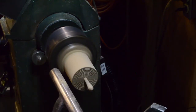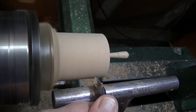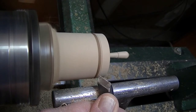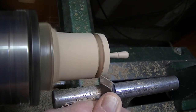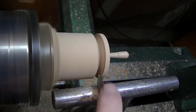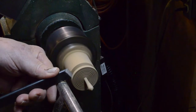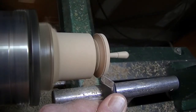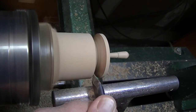Now, the working end of the top is going to be no more than a V cut here. So it's going to go from here down, and I'm going to start about here and keep taking a little bit more off the right side. Now, I'm down to a place where the tool width is buried in there, so I'm going to take a little off the waste side, simply to give clearance. Now back over here, work on the good stuff. More on the waste side.